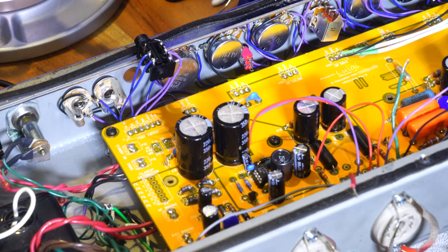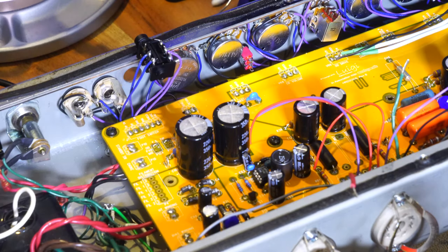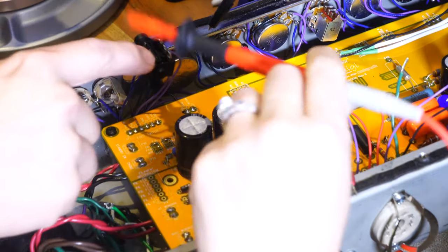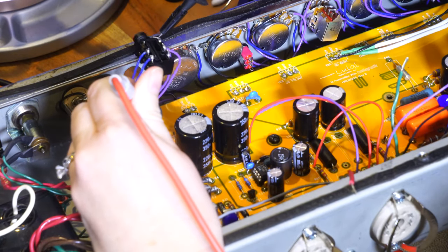Alright, so Angie finished soldering, as you see, and she was trying to test it and wasn't sure how to test it. So the first test really is just to make sure that all of the important connections are giving you continuity on all places, which with no switching in, really you just have to test both tip points to both tip points, and you should get continuity always on all of them because they're switched right now. That's the ground, that's good.